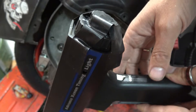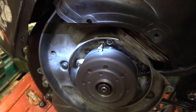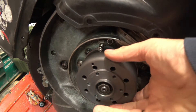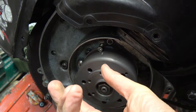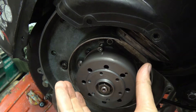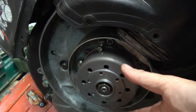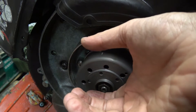What you could see was that the mark at 3,500 revs was a bit off — the firing point is clockwise of where we want, which means the stator is also clockwise of where we want. To get the timing mark where we need it, we've got to turn the stator plate anti-clockwise, and the timing mark will follow anti-clockwise. It only looks like two or three degrees, so it shouldn't be impossible — just a matter of taking the flywheel off, adjusting the stator slightly, and putting it back on again.